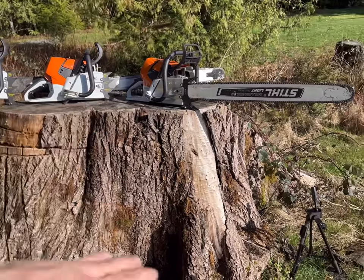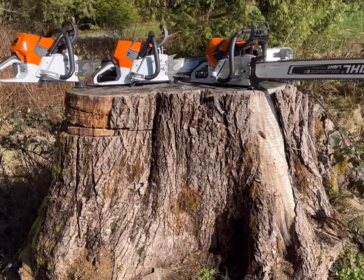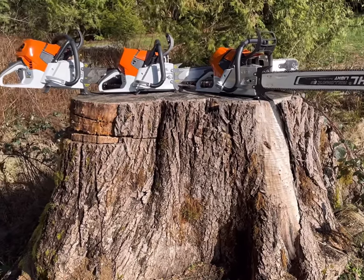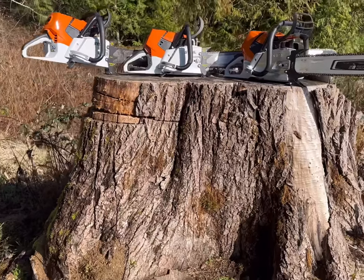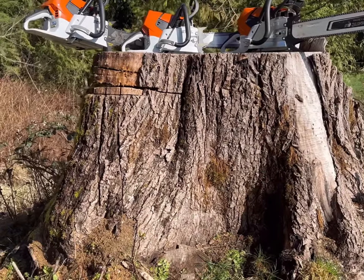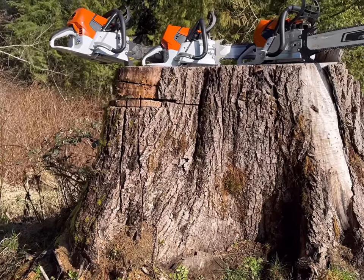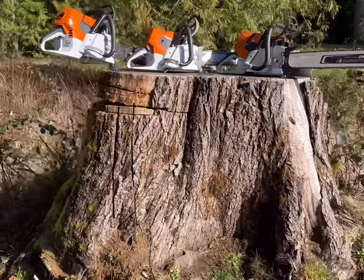I came up when I cut this tree because I didn't care about saving board footage, but somebody trying to get as much board footage as possible would want to cut this tree lower and would have to deal with this swell butt. When dealing with swell butt, if you're running a smaller dog like a factory one without a lot of space between the saw and the end of the dog, your saw will kind of slide around on the stump and it won't grip very well.